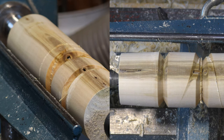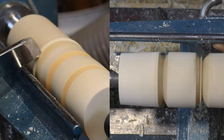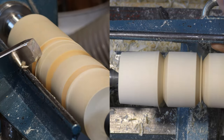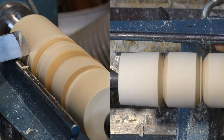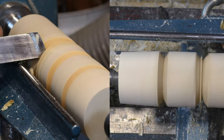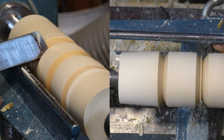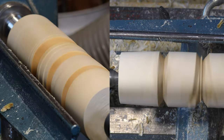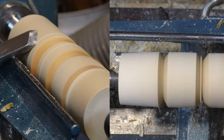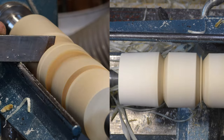I'm going to roll those into beads. I'll just do another couple of grooves up here first, just using the point of the tool. That was the genuine article — a real catch. Just if you'd like to see the genuine article there, it was a little bit minor, but it'll go soon enough. Gone.